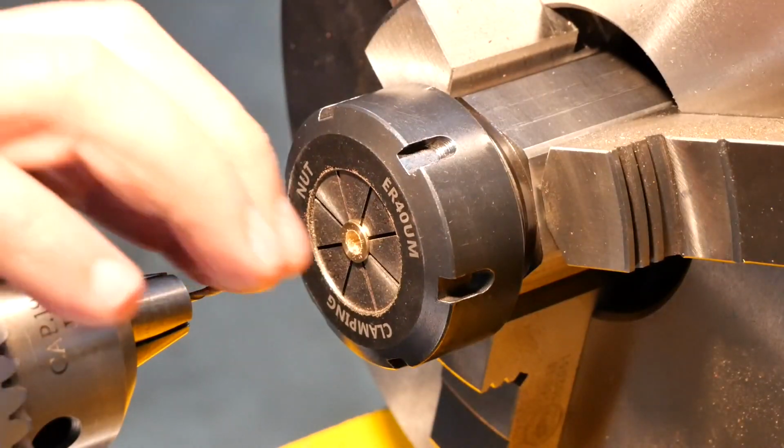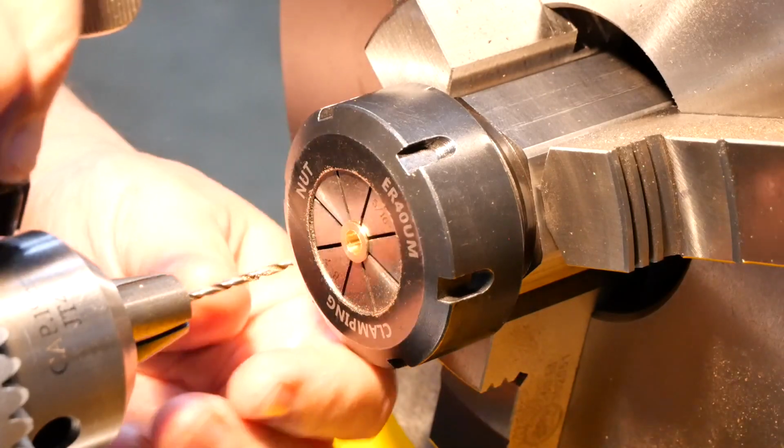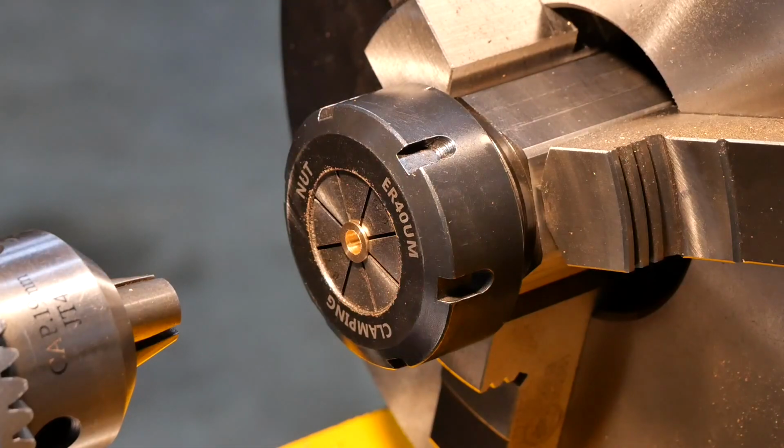It's pretty hard drilling gently on a machine this size with such a small drill. Just the weight of the hand grip on the tailstock handle was trying to turn the drill in faster than I wanted it to go. Perhaps I should have been doing this on the Hercus. But I got so used to the DRO, I don't like using a machine that doesn't have the DRO now. Mostly because my eyesight's not that great, and trying to read the little dials on the Hercus is not that easy for me. Anyway, by the by.